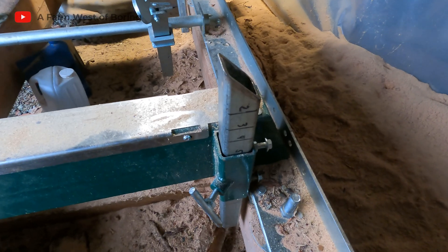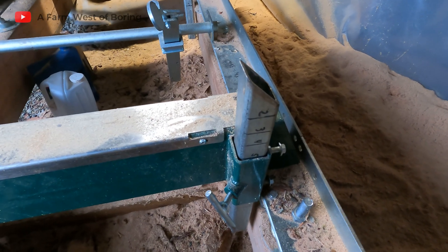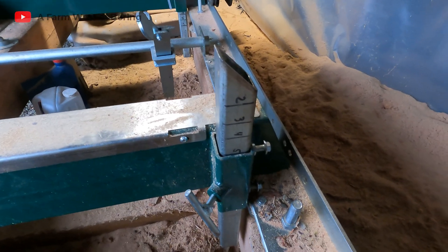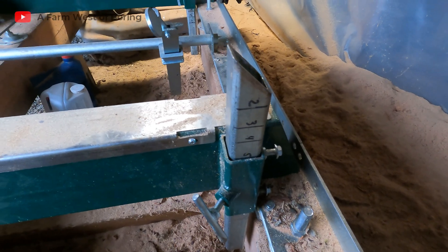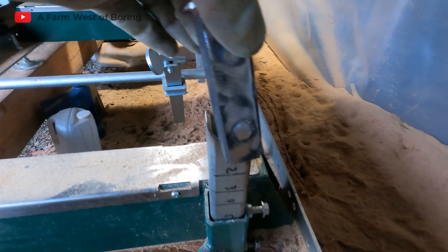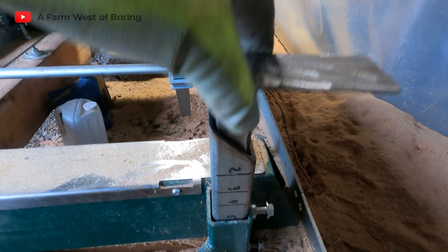Let's check it out. Here's your typical log stop — this would be too high right now. When the saw blade came along and was tracking a little bit under five inches, it would take the top of this right off. So now let's take this and stick it in here. We'll set the saw blade up at five inches and see what happens.